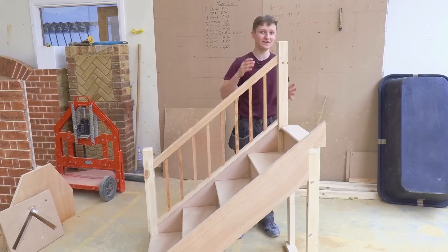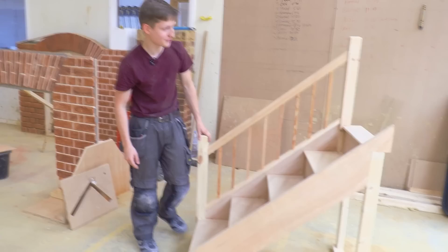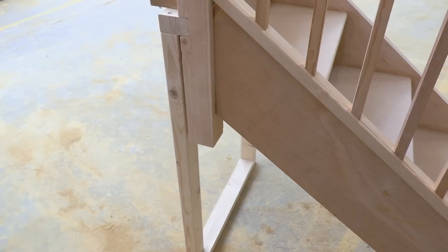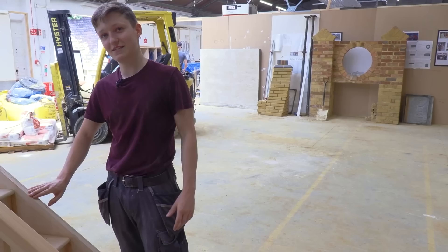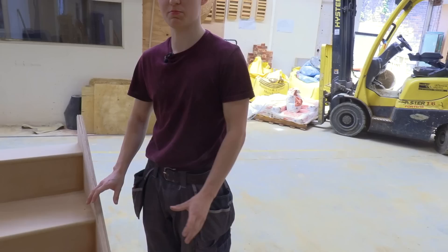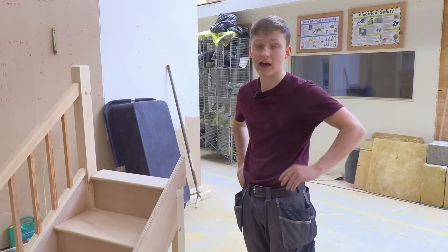It's a bit narrow, but it's all to regulations. It was actually designed to fit under my cut roof with the eyebrow window - it fits perfectly underneath. It's all mortise and tenons, properly wedged underneath with the risers, and you can walk on it. I laminated the treads and stringers, ripped them down with the skill saw, made them by hand, glued and planed them - all done on a set of stools. It will be at the end-of-year show at Carpenter's Hall, along with my roofing jig. There's some lovely work from others too, like the tuck pointing.